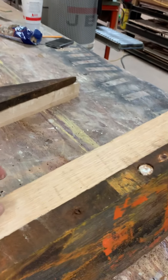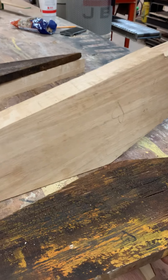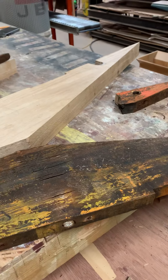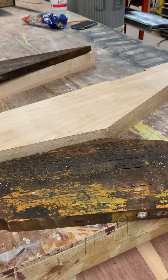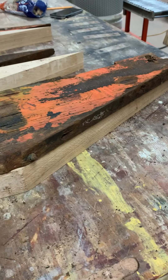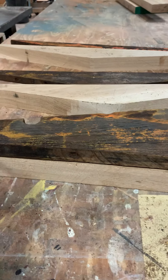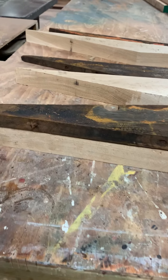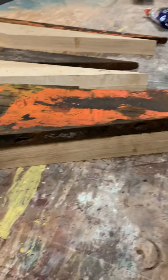So this is our plan going together. We made the new piece — we buy all of our white oak in eight-quarter, two-inch thick. Rather than going to the trouble of resawing and throwing away almost half the material, we're just going ahead and making these larger. This one is going to bolt up and go back in position, this one's going to hold the remaining portion of the rib that's on the boat, and this one will have a new rib that goes all the way across both sides of the boat, and we'll bolt all that together.